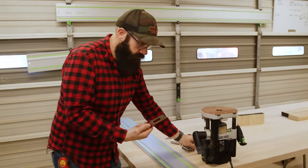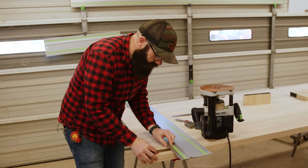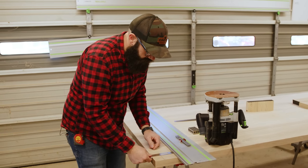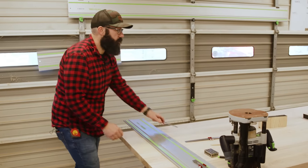We added two inches to that, and what I did is I took this line and put it right up against there, put our fence here, and then I took another rule and set the stop to this depth. So now we're set up on this side and we'll do the same thing on the other side, and then we're going to clamp it down.